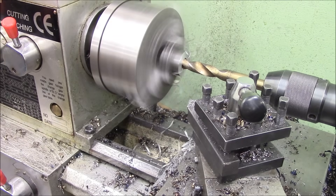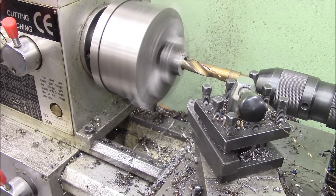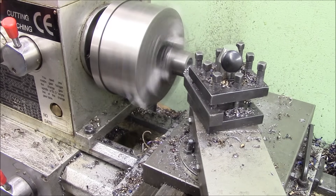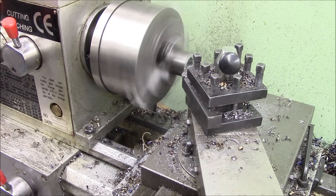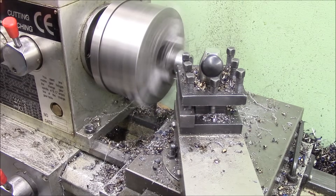So at school I've gone back to high-speed steel — I can sharpen them super quick and I don't go anywhere near as many cutters as when we did carbide. At home I use carbide cutters because I can turn the speed up and cut really well. I really enjoy it. But for school, it's fine.